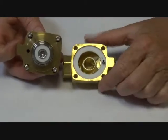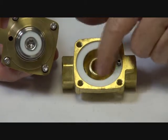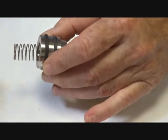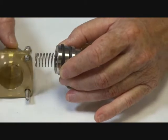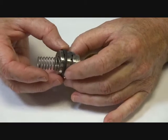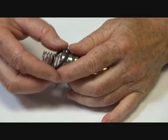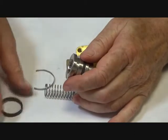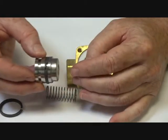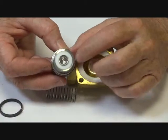Inside here it's all PTFE seals. There's the main piston, main seat, and the pistons themselves — it's a piston valve. It's similar to a car piston; inside underneath here there are springs which hold the unit in place. The PTFE seat is held open by the spring underneath it, so the spring holds them open. The piston goes up and down; there's a wiper seal at the base and the main piston at the top, all 316 stainless with a PTFE seat on the base.